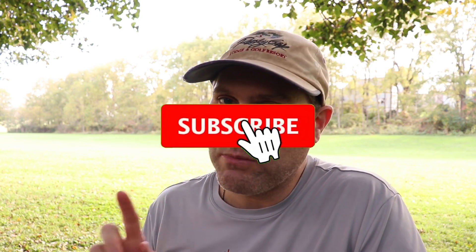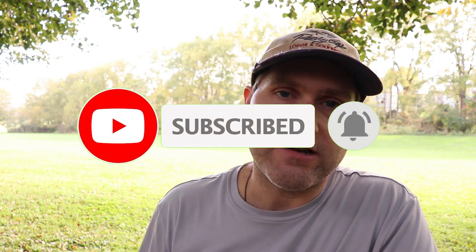One final tip: run everything on DC that you possibly can. I've rewired devices that came with AC plugs directly into my DC system. Running DC through an inverter to AC and back to DC through an adapter wastes about 20% of your power. Avoiding that conversion on monitors, laptops, and phone chargers makes a meaningful difference. Thanks for watching — subscribe and hit the notification bell for more videos. We'll see you down the road.